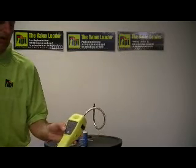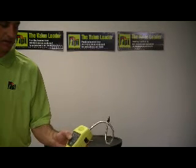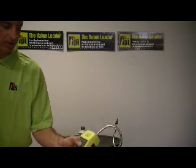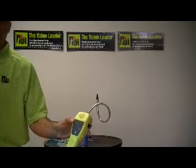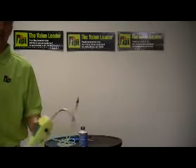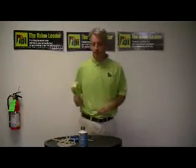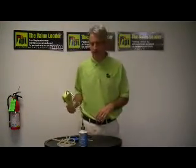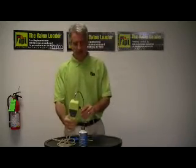In this particular model, I've got high and low sensitivity. In this instance, I'm going to check the high sensitivity and then hit the reset button. As soon as it shows green again on the LED lights across the top, I can go detect my leak source. It's very simple — I'm just scanning the refrigerant line, coming to my leak source, and I've got an audible and a visual alarm.